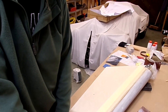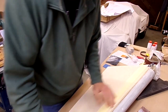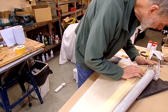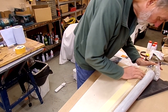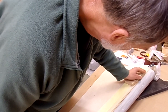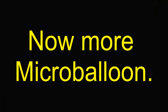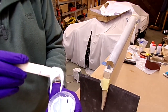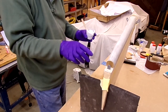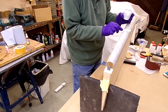Well, I've trimmed it quite harsh, so I'm putting tape down to protect the plywood when I do the sanding. So just use a fine board, and I'll just go along that edge there. And that just gets rid of that little lip of fiberglass that's there. I've created quite a stiff paste mix there. This is going to go onto the leading edge to feather bits in, and most of it's going to get scraped off here.